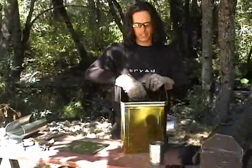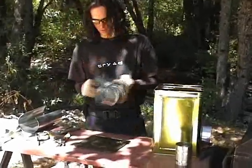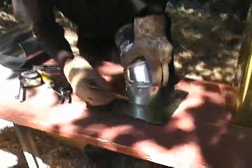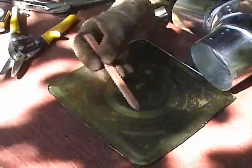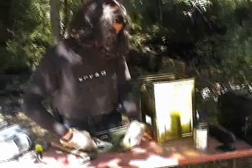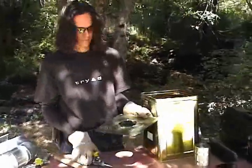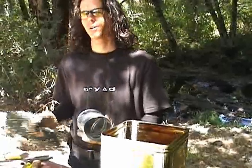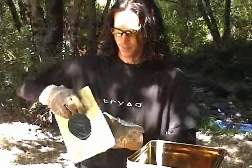With this kind of lid that goes over top, we're going to have to cut the outside edge off. Take one of your pieces of stove pipe — in this case the front of the elbow — lay it down on top of your lid in the center, and draw a circle around the edge. In our case there is already a circle here. Once again, take your chisel and hammer to start the hole, then take your tin snips, put them in, and cut around it. Once you cut your hole, make sure it fits over the stove pipe.